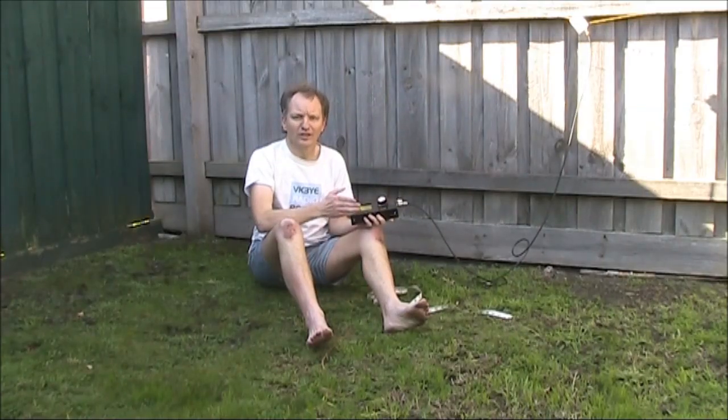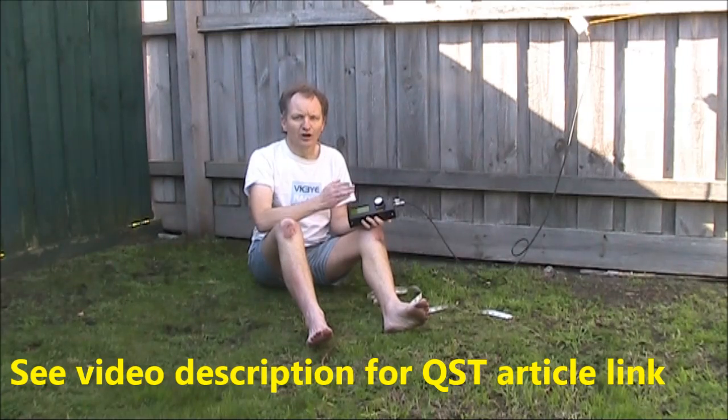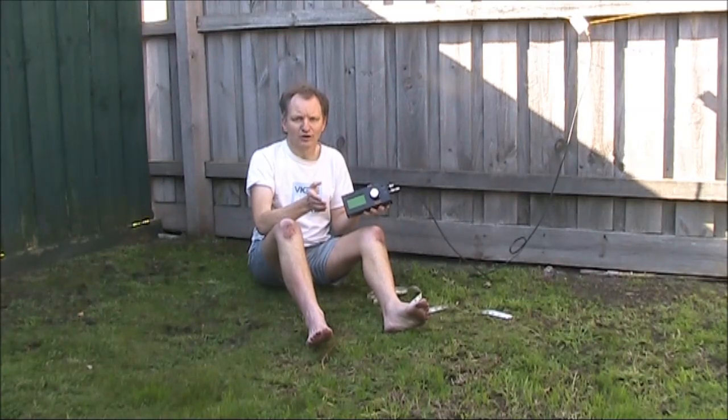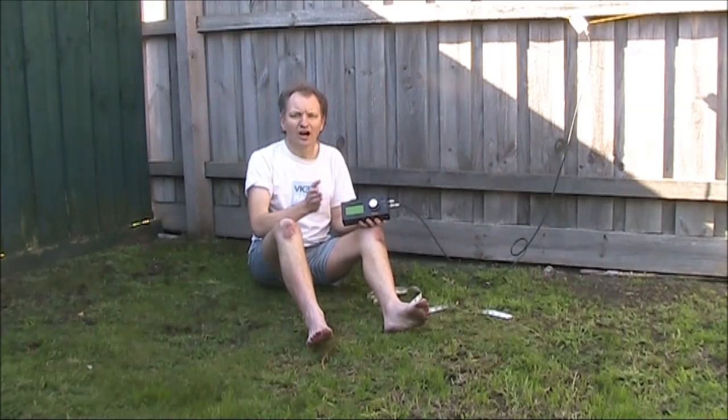I'm not going to put this on the air — that's for you. Try this antenna. All you need is a little bit of wire, a 4-to-1 balun, and an antenna analyzer, and see how you go. Let me know in the comments below. I certainly haven't refined what I've got here, but I'm sure you'll agree it's certainly something promising if you want a simple dual-band antenna. You could scale up its dimensions — for instance, you might be able to have an antenna that does both 40 and 20 metres, maybe even higher bands as well.